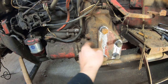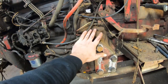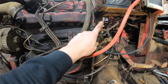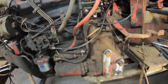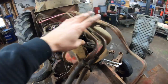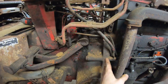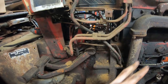That is right here. There's a seam. There are bolts holding the 2 halves together. And that's where I need to split it because the clutch is inside here. So the wire harness is going to have to get marked and unhooked from the engine side, laid over on this side. And you'll notice there's a lot of connections near this point for a specific reason. If I go on this other side, we got all these steel hydraulic lines, 2 for steer, the other one for the cooler, and they got all these joints conveniently right here, near where I need to split it. So I can split all these lines without chasing them one way or the other.